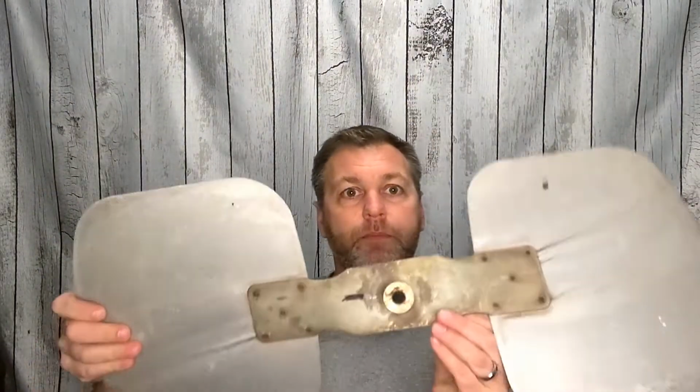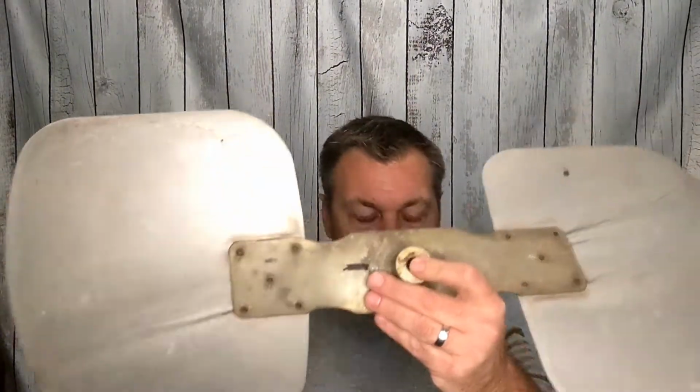Obviously, this one was pre-loosened for me. Normally, you're going to have to take that out. It does have a little square nut on there. You can use a crescent wrench, works really well. You just take that off there. You can get a little wrench that's made for these, but a crescent wrench will do you just fine. Either way, get that off of there. So now you've just got your shaft sticking out.